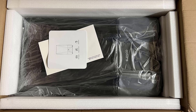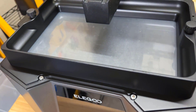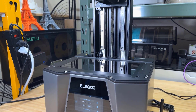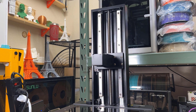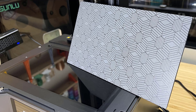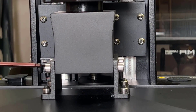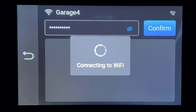Next, I will open the Saturn 3 Ultra. Besides using UV LED and LCD screens, I can see some other differences on this machine. It has a metal case instead of plastic, and the motion system of the Z-axis uses dual linear rails and a ball screw. The resin tray also uses frosted film instead of a clear one. The surface of the platform is laser engraved instead of plain aluminum, and it has 4 leveling screws instead of 2. There is a Wi-Fi antenna at the side, and we can send the print job directly from the slicer instead of copying it to a USB drive.